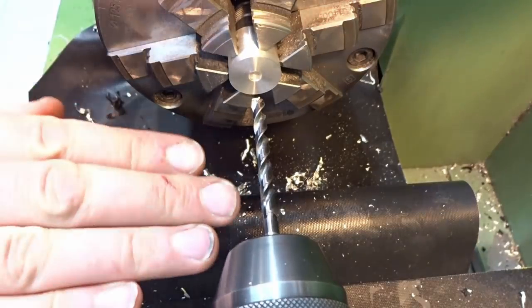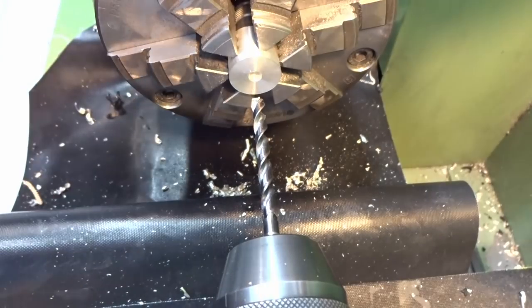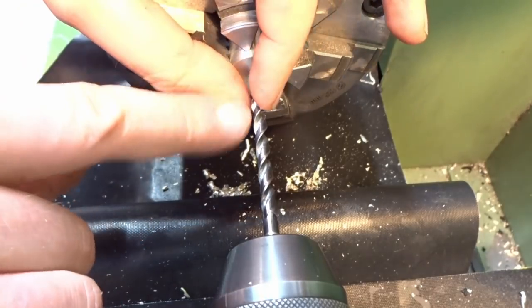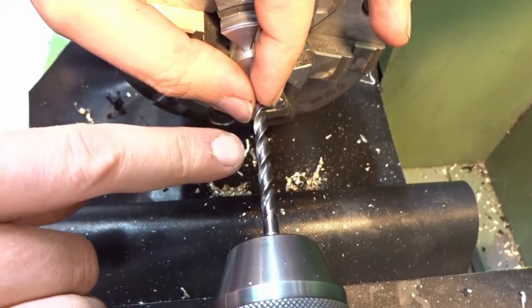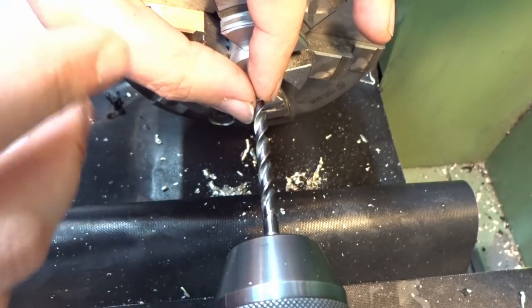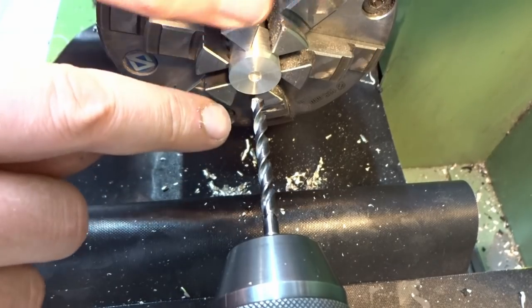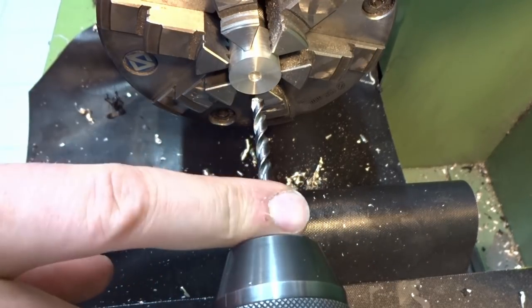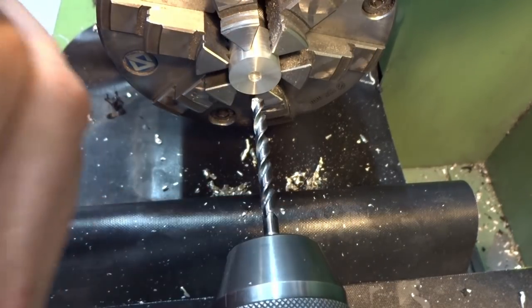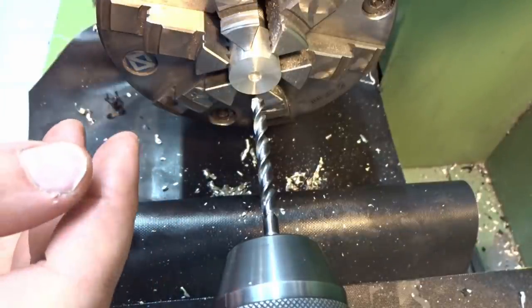We now change to a drill - like a 5mm drill - and it's all good. So you can really eyeball it. You can do the same for the height - just eyeball, look where the drill deflects, adjust accordingly. When you run very small drills like PCB drills, you will find that even with the drill chuck indicated in and then clamping a tiny drill, you will see some deflection in the drill due to the imperfect clamping of the drill chuck. Then you just have to adjust by eyeball if you want a very good hole.